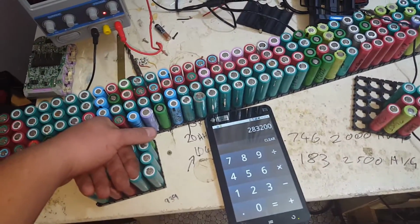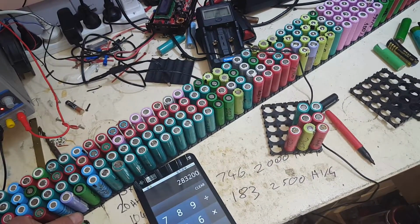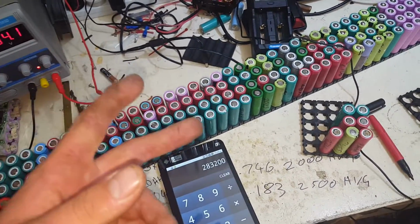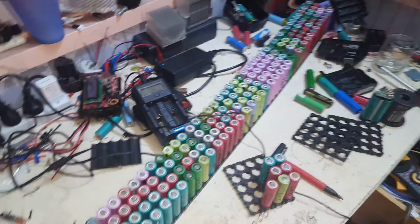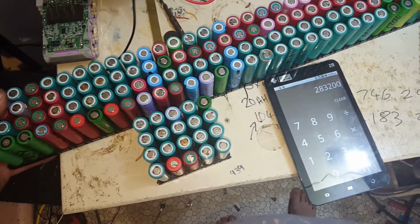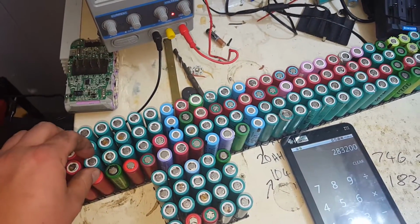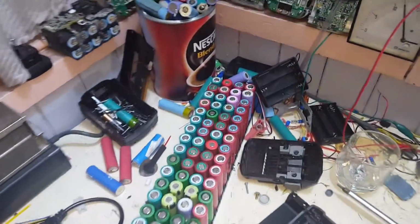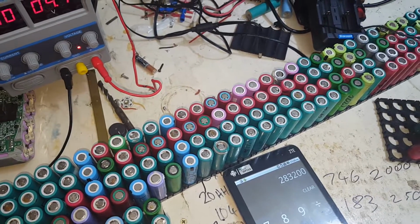It's a matter of working out how we get around less cabling, because the cost of this project, when you start adding 300 square millimeter cable, and the hydraulic crimp ends and all the bolts, the copper plates to go on the end of the copper bar that uses bus bars. Like, the project's going to add up significantly. It has to. I'd rather spend all the money I'd spend on that on an extra 10 kilowatt of batteries, or being able to afford a better controller, than wasting it on consumables and paying extra money for cabling.